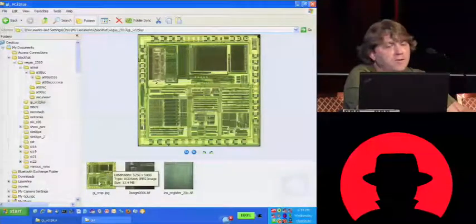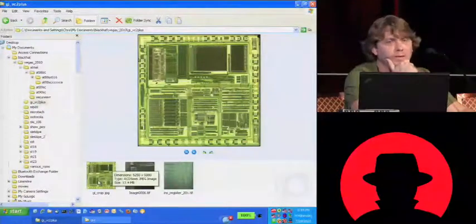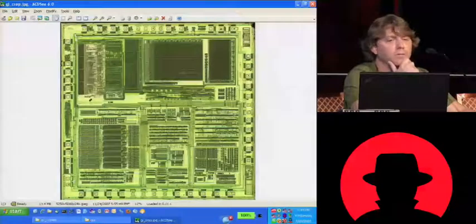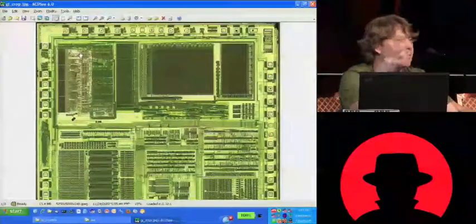So we go back to this General Instruments chip. Anybody familiar with the GI Video Cipher system? It got cracked back in, I guess, the early 80s. And then they came out with the 2 Plus. Never got cracked, at least not that I'm aware of. And I don't know why. I really don't. The chip might have been custom, but it was some type of a TI MSP4, like a TMS 370 type chip.